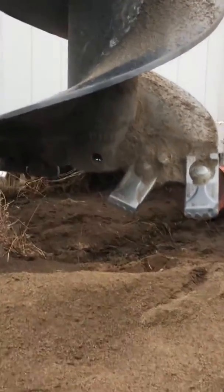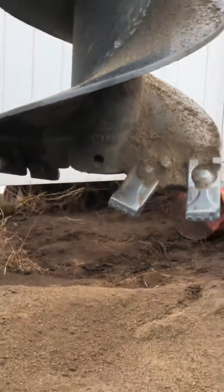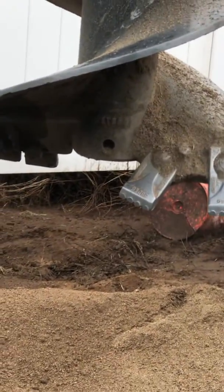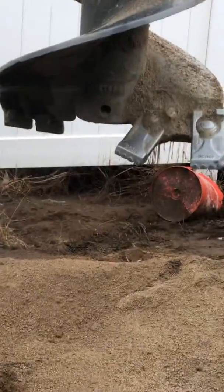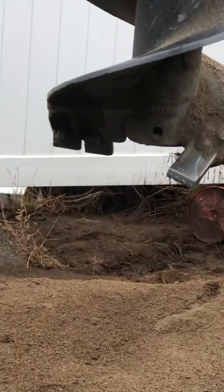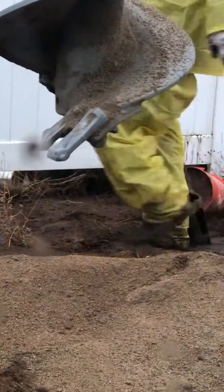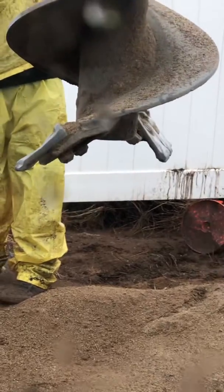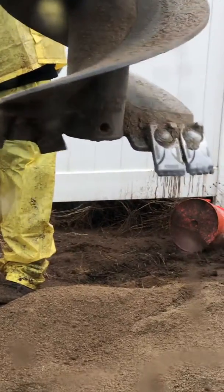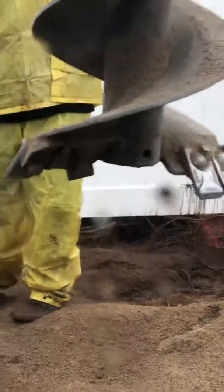And the pilot that's on there is about 3 inches long or more, and if you look at that, I already took it out. So just take that bolt off, cut it off, do whatever you do, it's welded, and then that has a flat plate now on the surface of those teeth for digging. And so you can get really aggressive now, because the first thing that is going to hit the dirt is actually the teeth. And it won't wobble now because I've already pre-drilled the pilot hole.